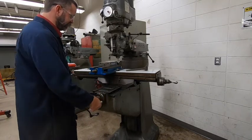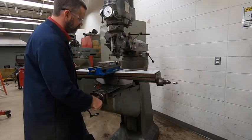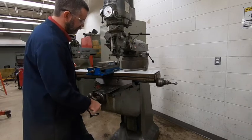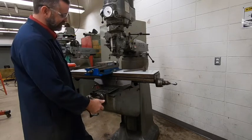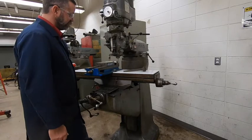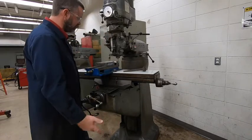I'm going to turn it about another 15 or 20 and go back through. Keep a nice, even speed when you turn the handle — that's going to give you a better quality cut. If you're going to turn, stop, turn, stop, your cut's going to be pretty rough. So we'll turn that off — looking at it, I don't have any marks, so we're in good shape there.